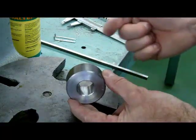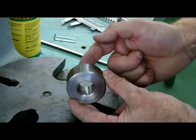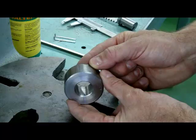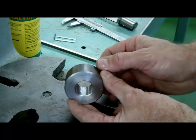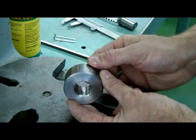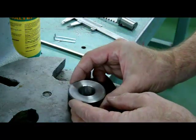It allows it to drive: as the shaft spins, this bushing or sleeve will spin with it also. The key acts as a breaking point, so if something happens to jam, it'll actually break the key and not damage the components.